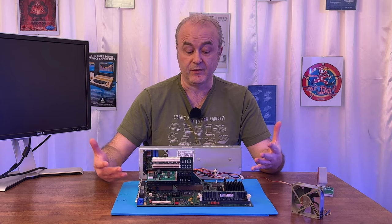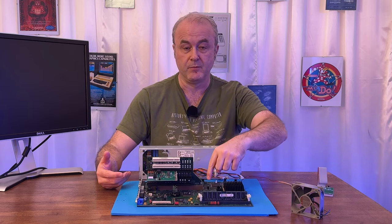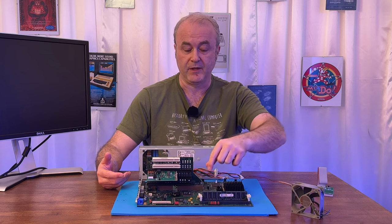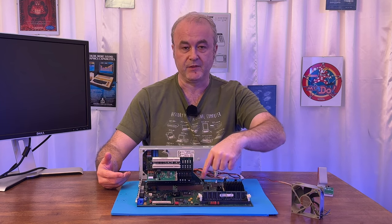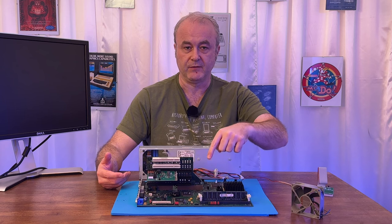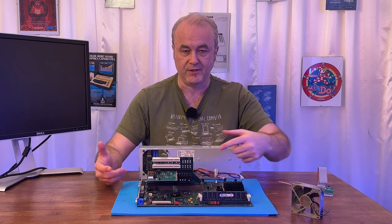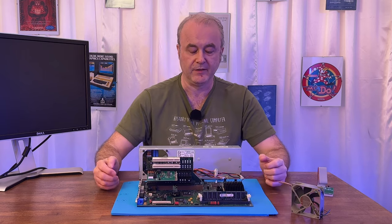So they decided to copy the BIOS from some storage. During the boot sequence, it gets copied and put into RAM. And to keep these chips at a reasonable size, they used to compress the BIOS so it would fit on the chip. It's pretty complicated, isn't it?